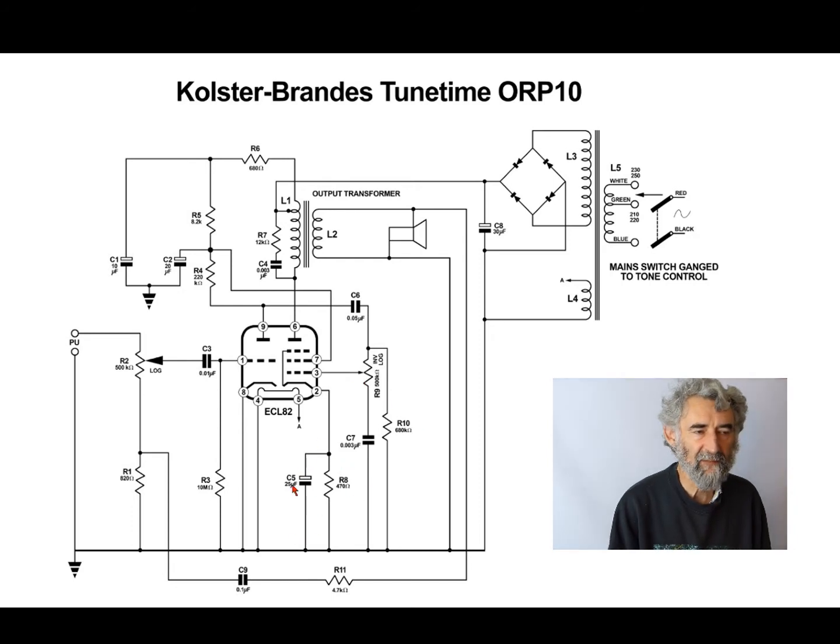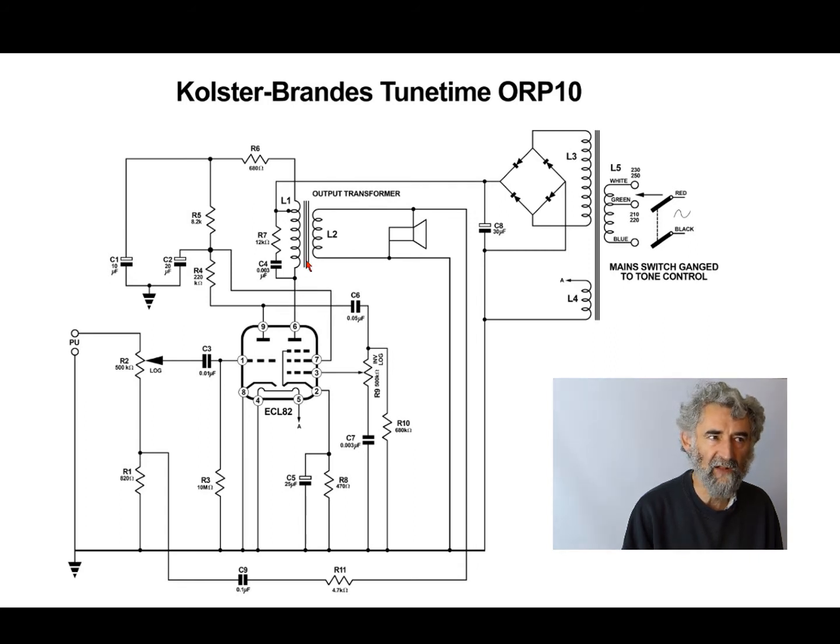There are conventional bias components in the pentode cathode circuit. Up here we've got another 3000 pF in series with a 12k — that's the pentode tone compensation. We also have an extra winding at the top of L1. It's a cheaper way of doing smoothing: there's a reservoir capacitor off the bridge rectifier with quite a lot of ripple voltage. The hum is induced in antiphase through this winding to cancel the effect in the output valve current. We then have a series smoothing resistor.